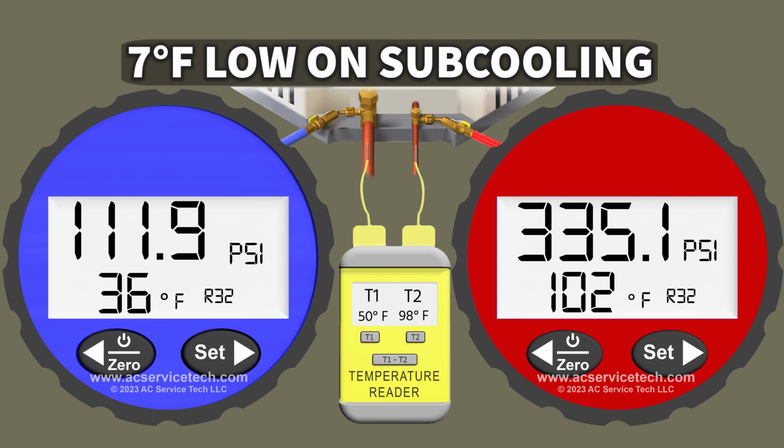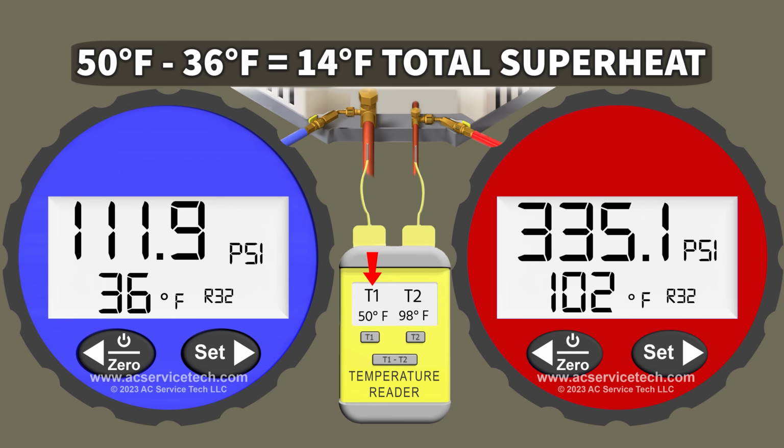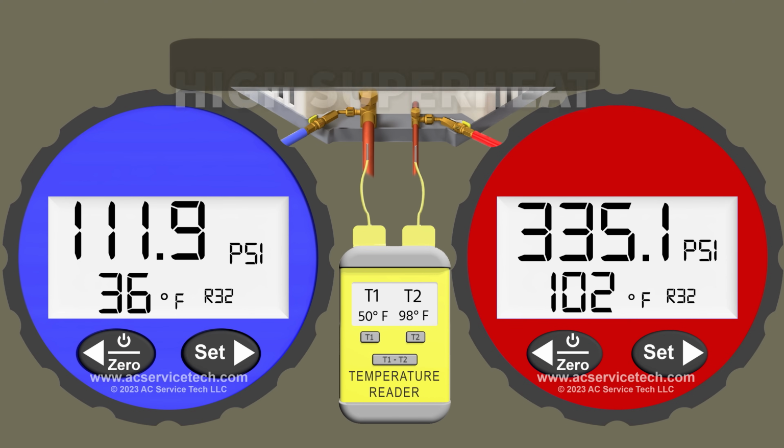And so that's also slightly reflected in our superheat as well. So our total superheat is the 50 degree vapor line temperature minus our 36 degree saturated temperature. And so we have 14 degrees of total superheat. So it's on the high side.